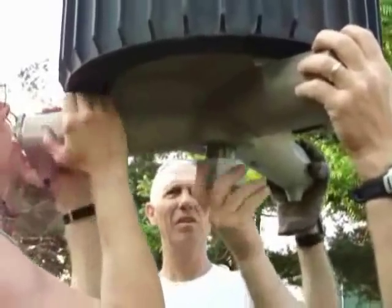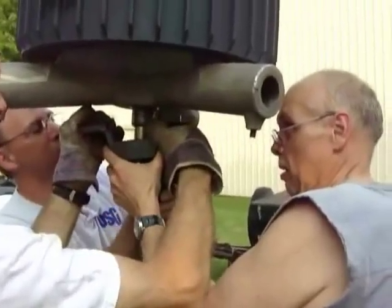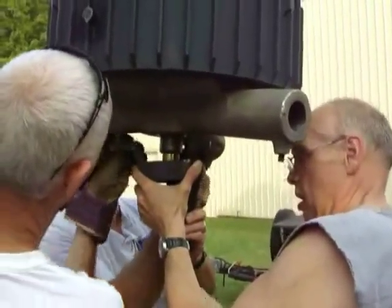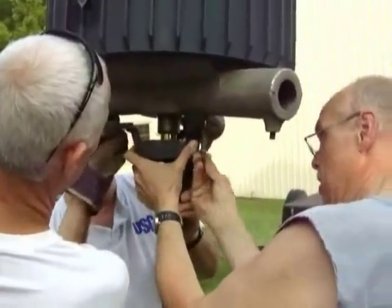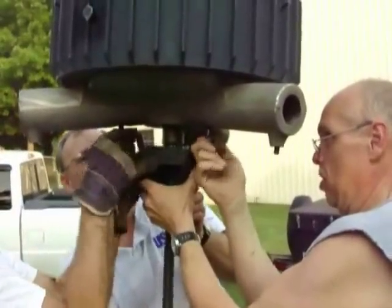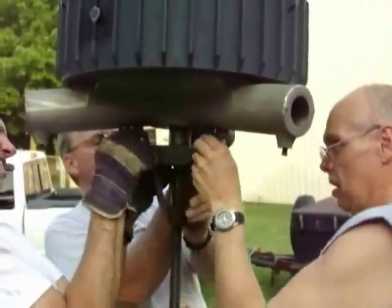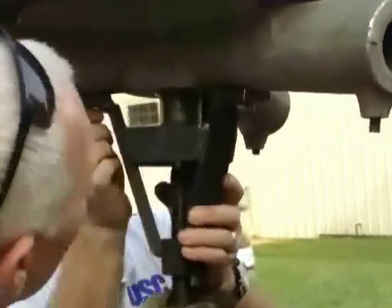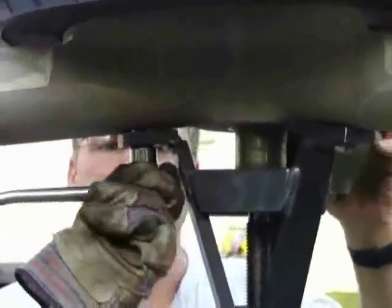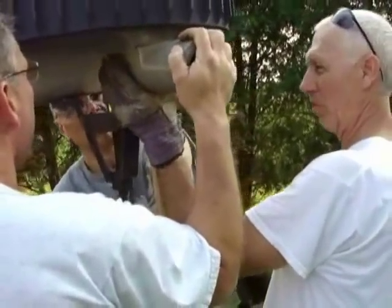We pulled it most of the way. We're putting a puller on it because the magnets seem to want to pull the rotor hub back up into it. I'm starting now — get them all snugged up — just to make sure we don't pull the thread loose. Just when it comes, when it breaks its magnetic pull...